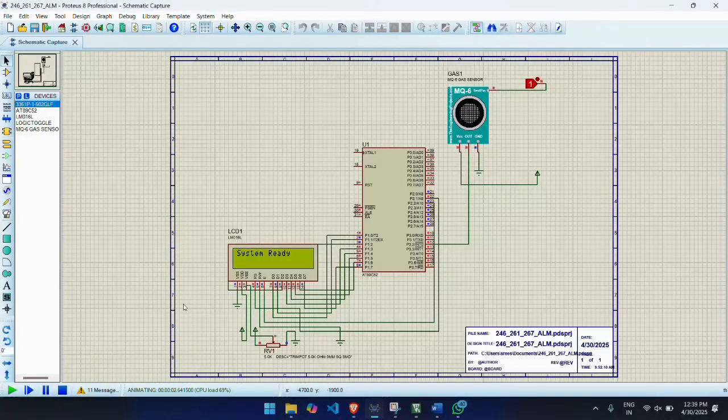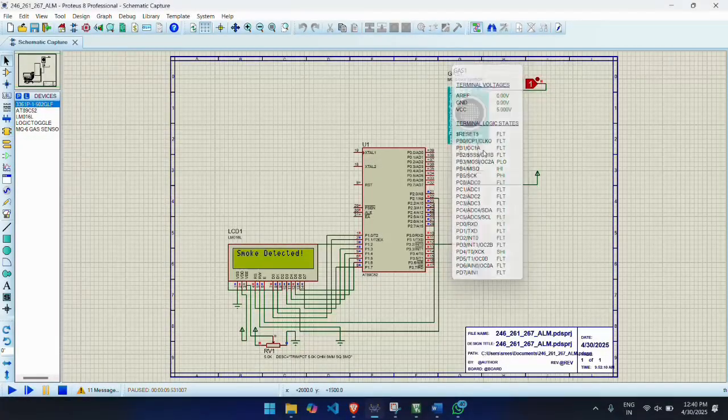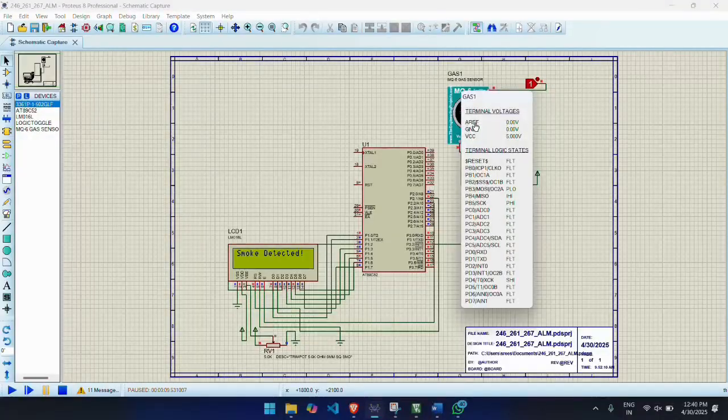Click the build button to build the program and make sure there are no errors. If there are any errors, rectify them. Then go to the project, open the options for target, click the output tab and check Create HEX File. After checking it, click OK and rebuild the project. It will create the hex file to upload in the AT89C52 microcontroller in Proteus.